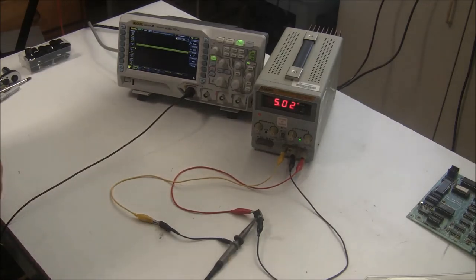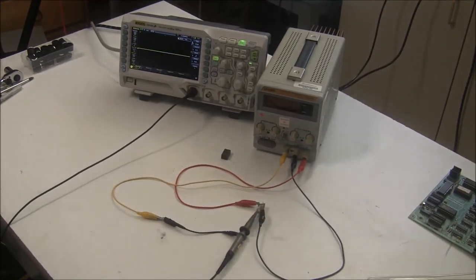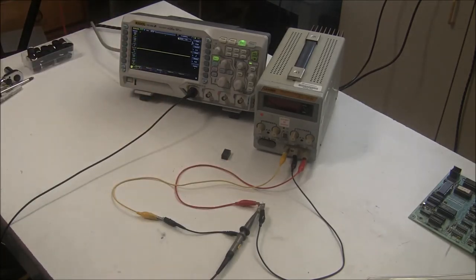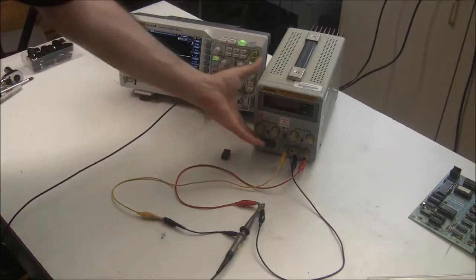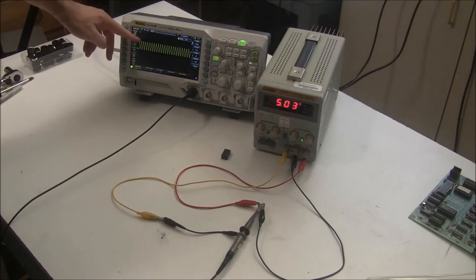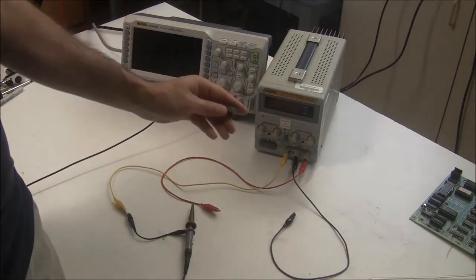So this oscillator is bad and needs to be replaced. I'm going to see if I have one with the same frequency. I don't have a 5 MHz oscillator — and this isn't just a regular crystal, like a quartz crystal; this is a crystal oscillator, which is different. I had one of another value here to show you for comparison — this is what a working oscillator looks like on the oscilloscope. Ours wasn't making it down to zero volts and it didn't look like this. So this is at least one problem preventing our Prophet from working. Now I have a few possibilities for what I'm going to do about this.